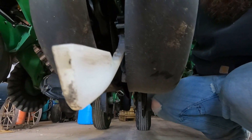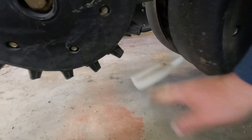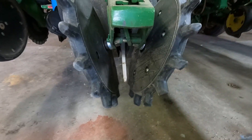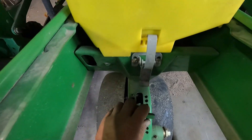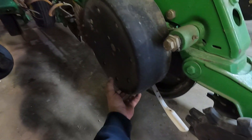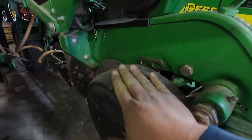If you can see it real good — it comes out down there. So the seed doesn't bounce in the seed trench. And then these are the closing wheels right here — they're spinning and closing the trench back up that those first two disc blades are making. And this right here is how we control how deep the seed is going to go into the ground. That's what these gauge wheels are doing — they can move up and down, and they are controlling how far the disc can go in the ground. The disc will cut in, so these will control how deep that seed is going to go.